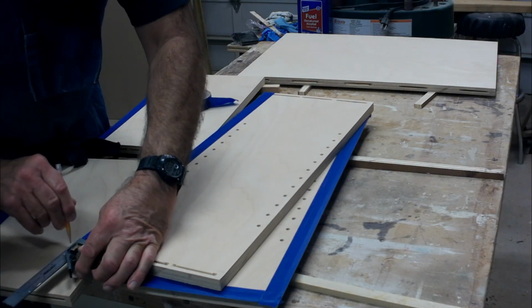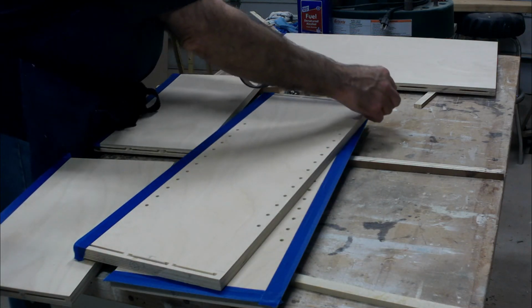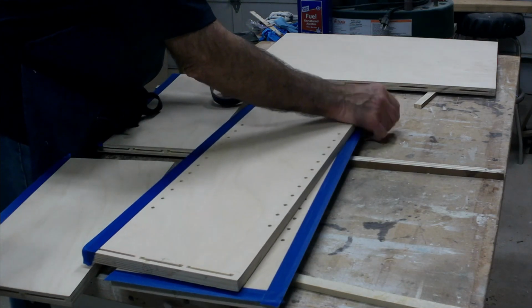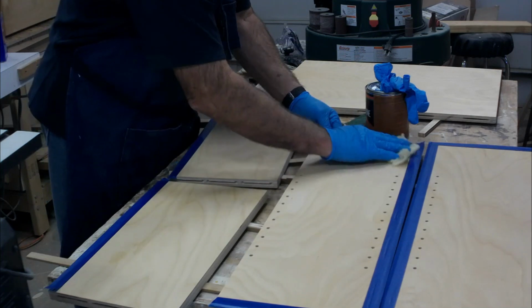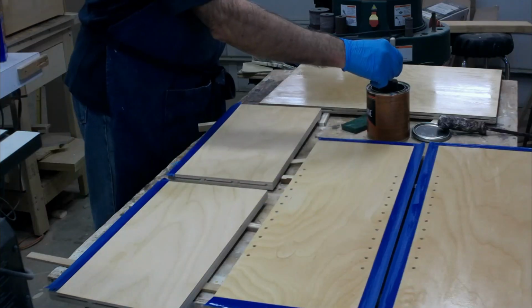Instead of covering the whole 3/4 inches of joint surface with tape, I leave 1/16 to 1/8 inch along the edges bordering the finish. Doing so ensures that there are no finish gaps visible when we glue it all up. After sanding, I brush off the sawdust and then use a tack cloth to remove any remaining dust residue.